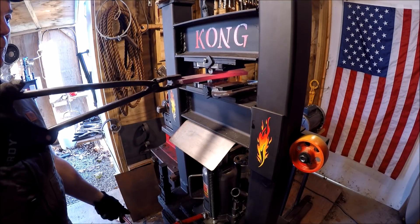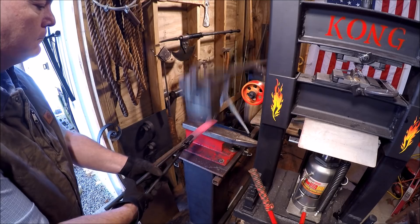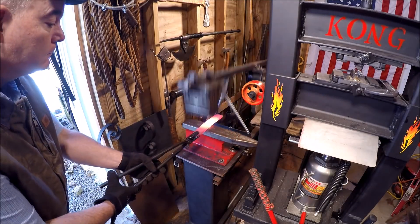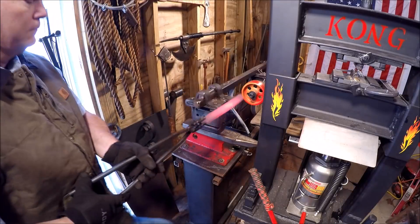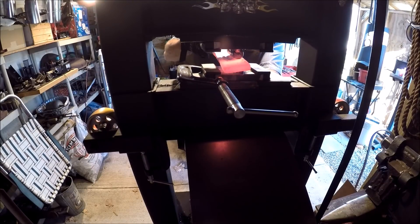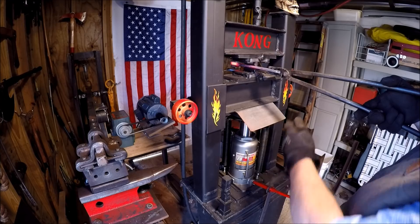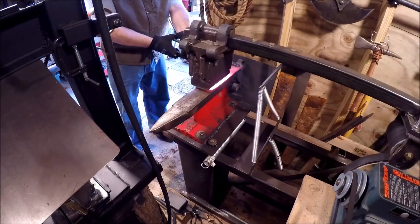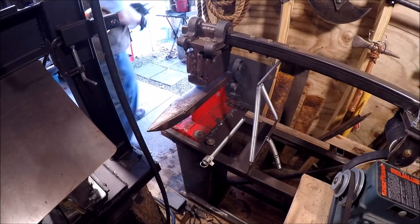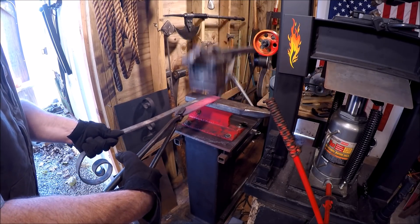Right now it's about an inch and a half wide. We're working up and down the whole billet, then we move over to the power hammer to smooth out any of those forge lines. A couple of heats on the power hammer and we're back to being smooth. That 20-ton press really works a lot faster than doing it by hand. We used a kiss block to get it to a consistent 3/16-inch thick.